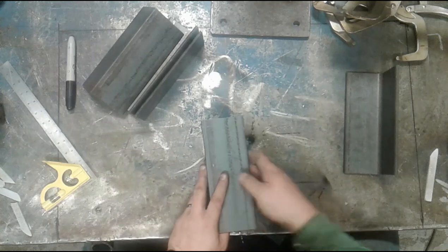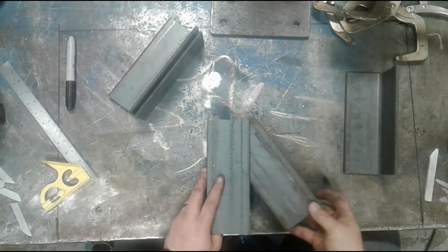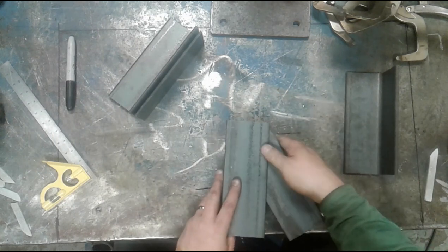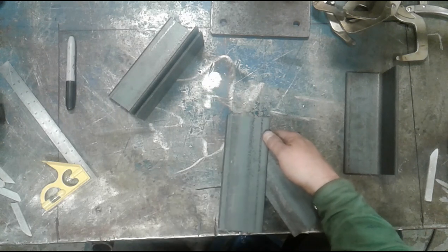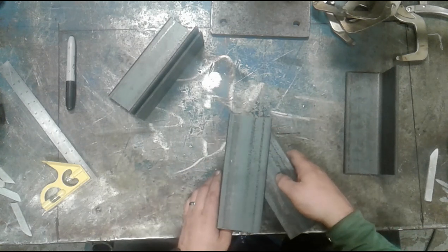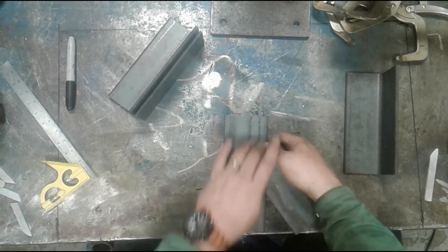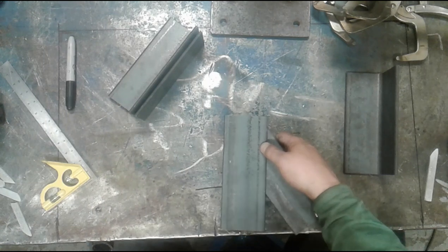If it needs to go on the inside, the process is going to be a little bit more complicated, and I'm going to set this just like this. The actual cut is not as easy to see. Now there's two methods of doing this. The first method is what I'm going to call kind of a cheat method, and that is to simply overlap the parts and scribe in the cut. That's actually a really good way to go.